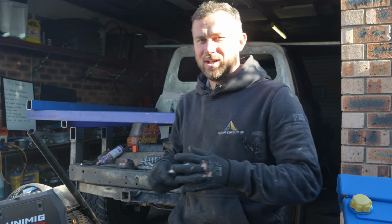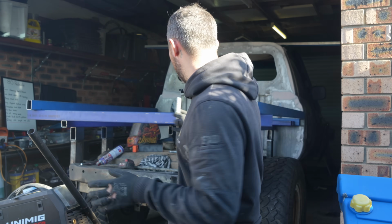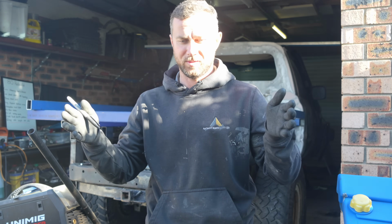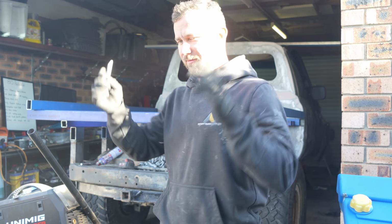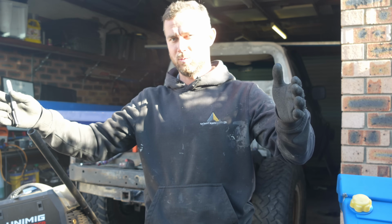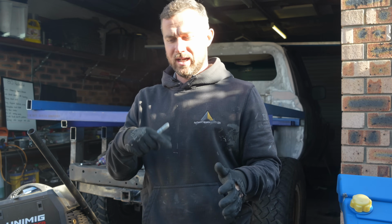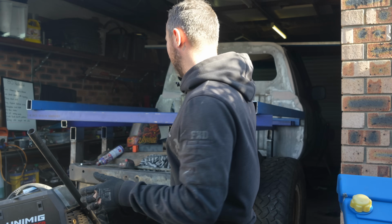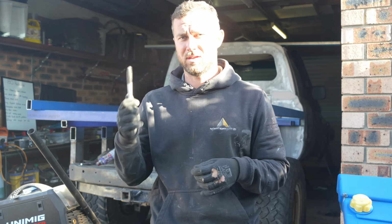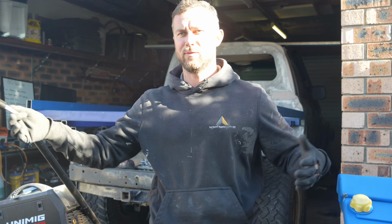I got my side pieces on, and the way I got them square is I did a couple of check measurements. I went off my supports and changed them in and out, top to bottom. And then I went from my dovetail grind mark out, made them the exact same, then made the overall width the same, top to bottom. Then I used a big tri-square in the corner on the front to see if it was square. Checked both of them, it looked pretty close. And then I did the 3-4-5 trick, which is how you work out if it's square on a larger scale.